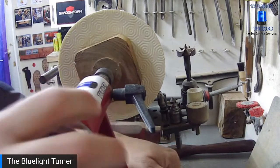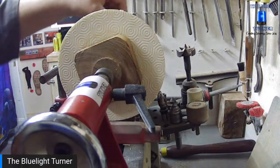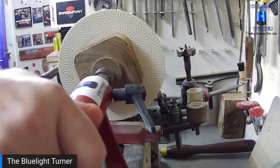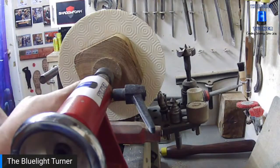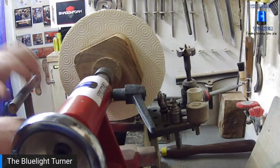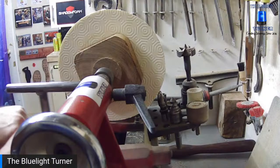All I've got here is a piece of ash acting as a table protector — it's also anti-slip. When I put the tenon on I did it between centres using the ring centre, which left an indent so I can make sure I get it square when I reverse it to take the tenon off.